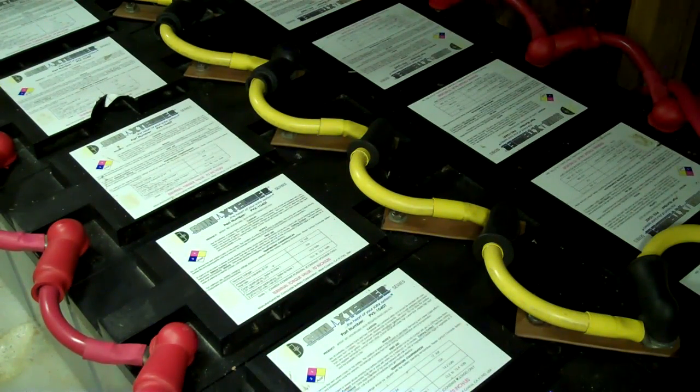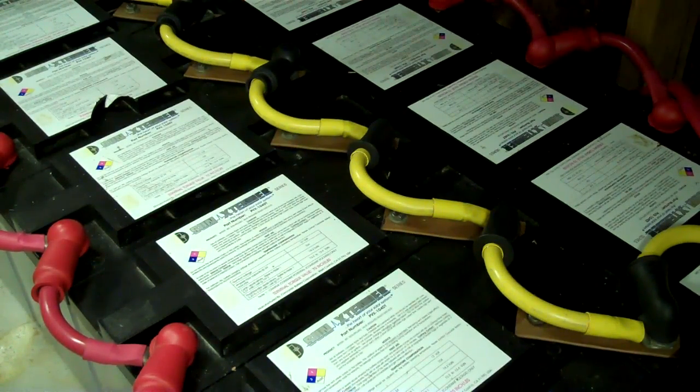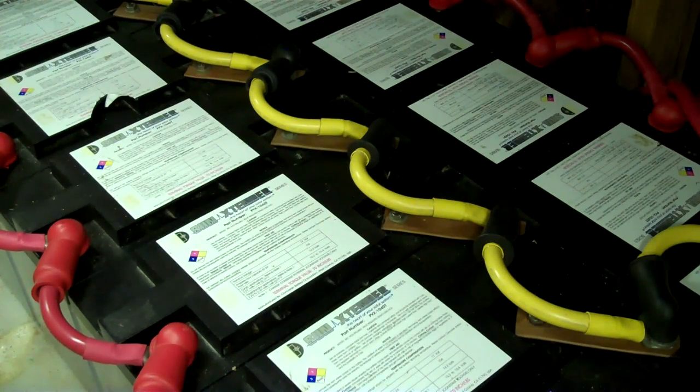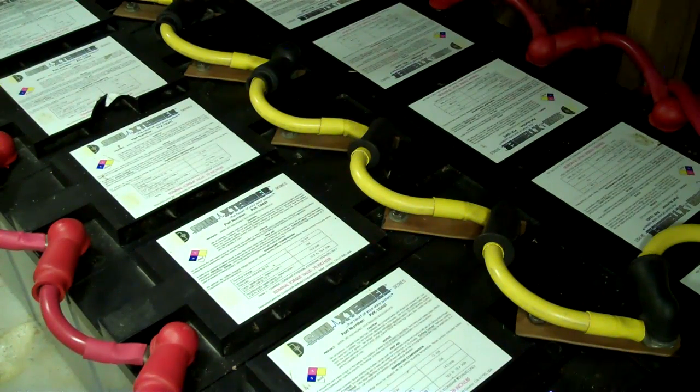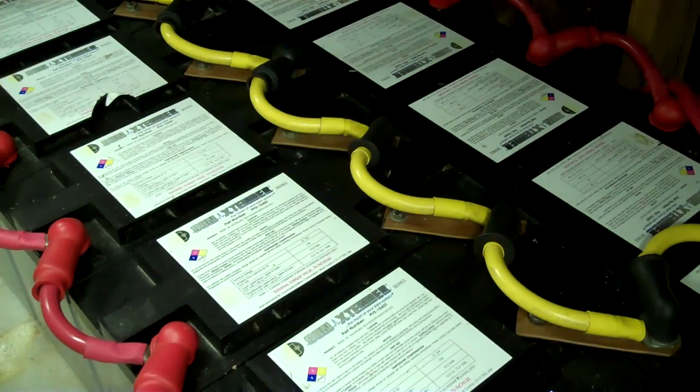Charging is really important. Here are some numbers with no charging and no discharging going on. A fully charged battery is around 12.7 volts. At 80% state of charge you should have around 12.5 volts. At 60% state of charge, around 12.2 volts. At 40% state of charge, 11.9 volts. At 20% charge, around 11.6 volts. Anything below 11.5 to 11 volts is getting close to a dead battery. For 24-volt systems double those values, and for 48-volt systems quadruple them.